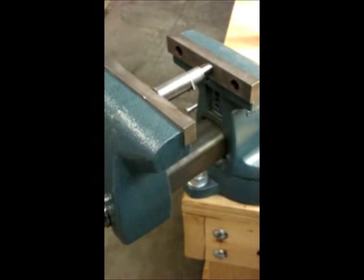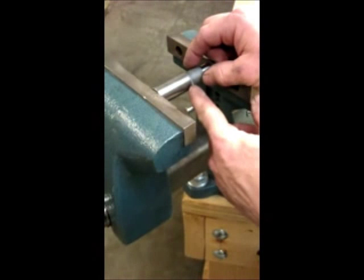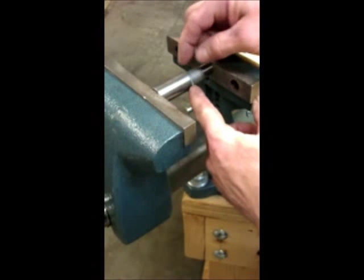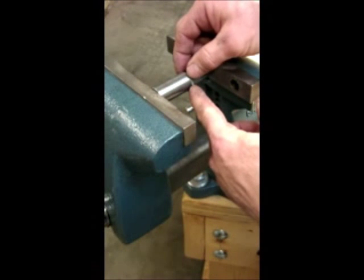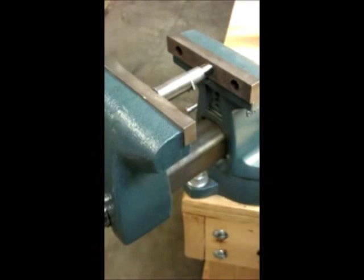We'll start with the smallest one first, we put a little oil on it, and we've taken measurements, and we should be able to get by with expanding five thousandths, no problem. We've already got a good tight barrel-to-bushing contact, so we should have good barrel fit when we're done, and good slide fit when we're done.